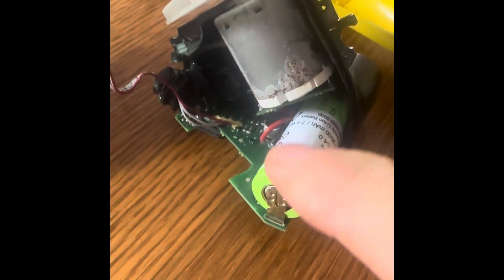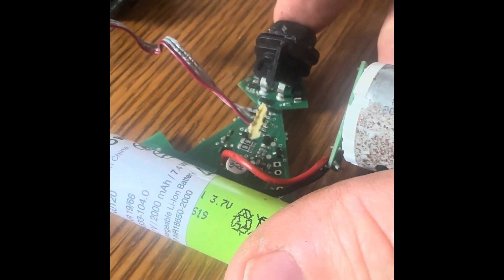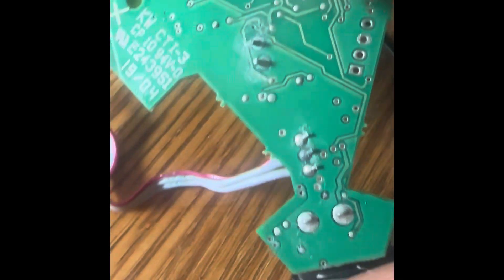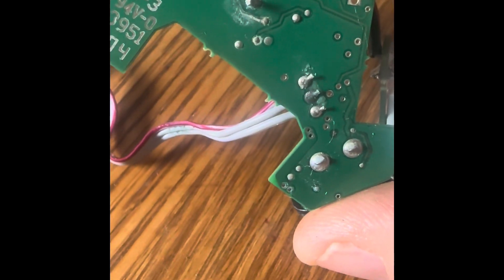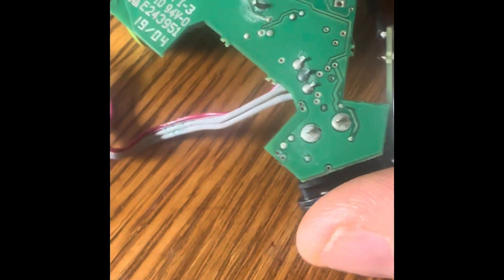I reckon it could be that battery. With any luck we might be able to replace it, but it's all sealed, so obviously when you put it back together make sure it's watertight. I've plugged the charger into it and I still have 5.5 volts against those two little terminals, so power is going into the board. But looking down there, that middle terminal is discolored — the other two are okay. So we could try putting a soldering iron on there to reflow it, as it might have oxidized.